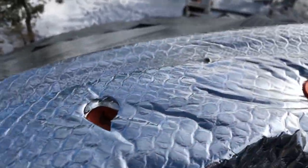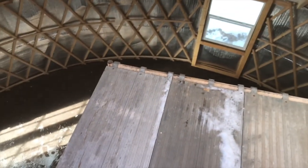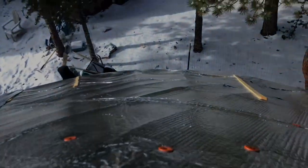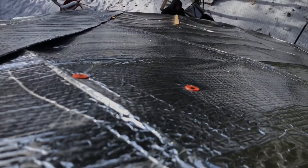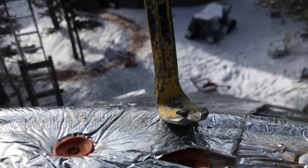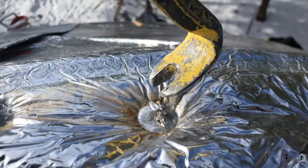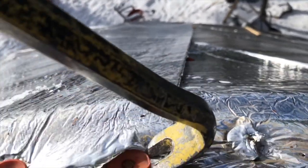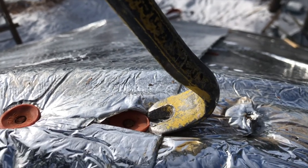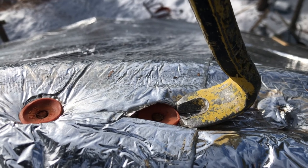So I'm gonna get these off and get it so that I can poke my head up through the scaffolding, and then should be able to remove those without having to climb onto the roof all the way around. All right, to take these out, I got this thing. I guess some people call it a cat's paw. It works pretty easily, doesn't damage it very much. I can just get that in right here, tuck it underneath, hit it with the hammer, and it pries it right up. Seems to come loose, so that's what I'm gonna do for this.